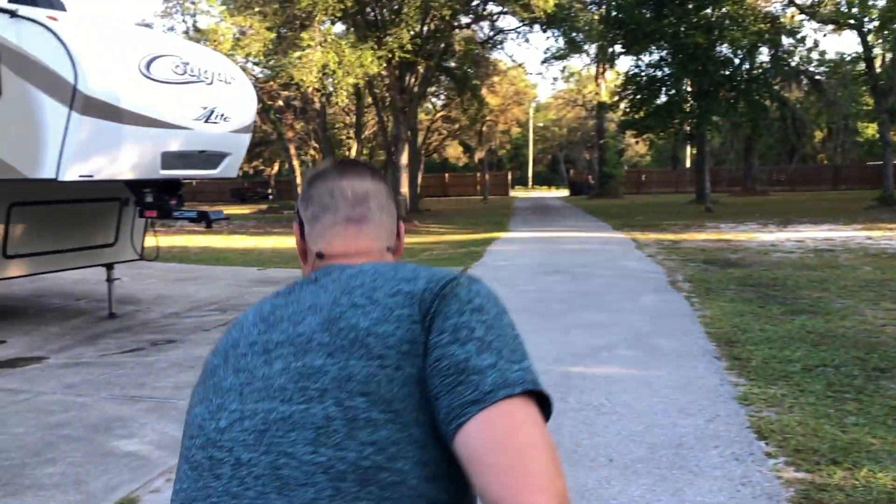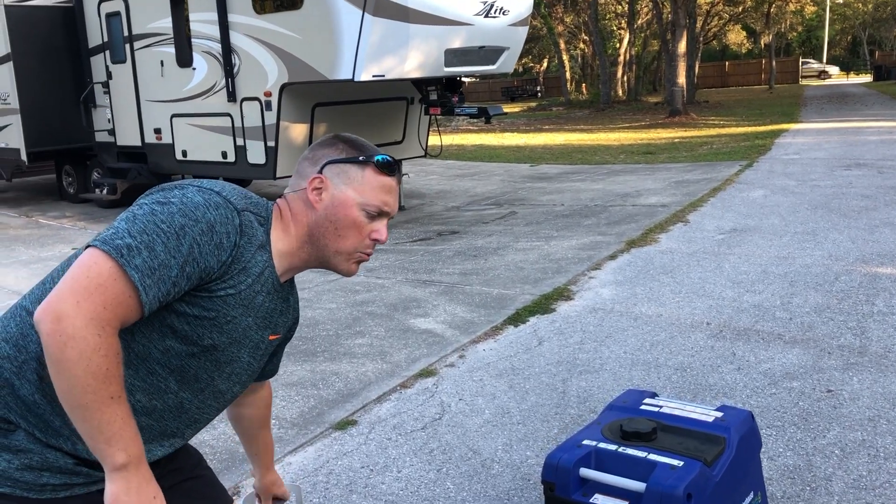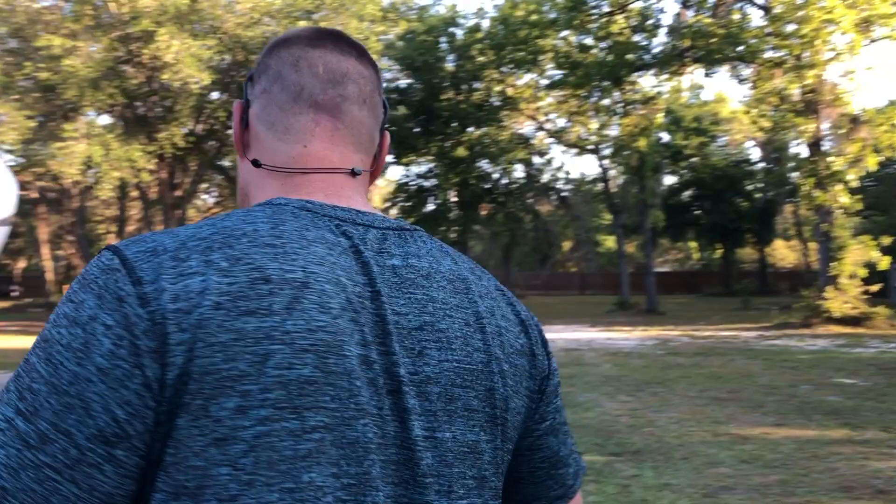So that's what I wanted to show you guys, because a lot of people were asking what you experience when you're running on propane versus gasoline. So now we're going to repeat the exact same test running on gasoline. I'm going to do the exact same thing. I actually just ran this twice and overloaded the system because I was running over 20 amps on some of these. So I'm going to back it down a little bit, but what I want you to hear is the difference in how the motor sounds and the difference in how the amperage drops and stays there and never comes back up. That's the big difference between propane and gas.